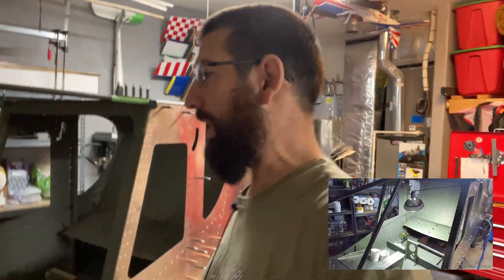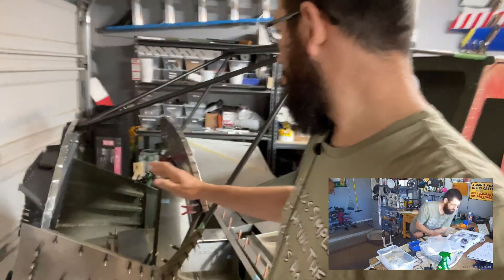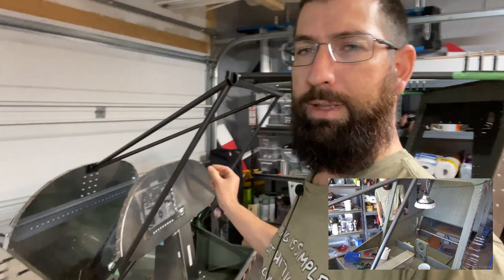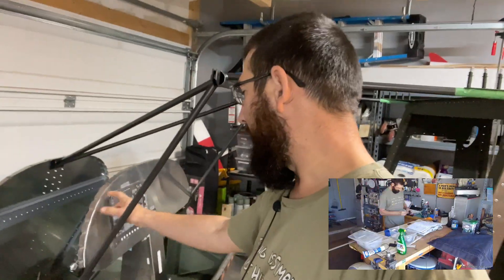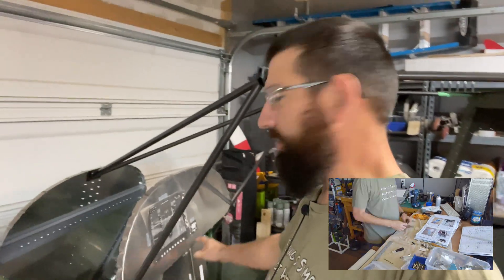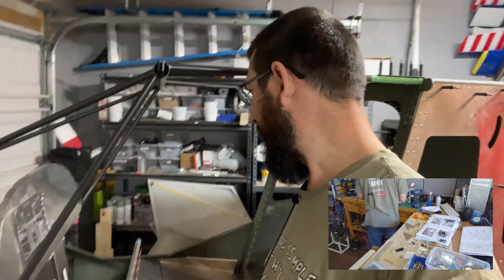I did order a little bit of extra aluminum sheets — one for the panel. We're going to be building an avionics shelf up there in the front section. We're also going to be doing a modification to the panel. I'm going to make two separate panels because I bought a little bit thicker aluminum, just one size up. Then we're going to cut that out and put nut plates, with a support down the middle section. We'll add nut plates around here so we can put a panel that's going to be modular.